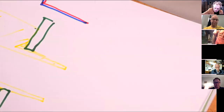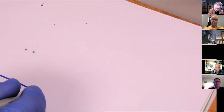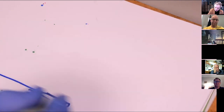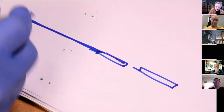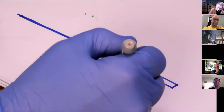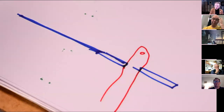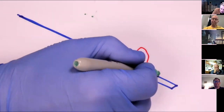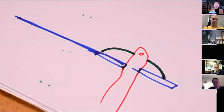So again, just going back to our cutaway thing, let's move across here, splash out a new bit of paper. Here's our hand, terrible drawing, but anyway, in section. And here's our center, like that, with a little pinhole through it. Really important that the collet sits, as you've just seen, kind of like that. If it's flat on the back, it'll wobble.